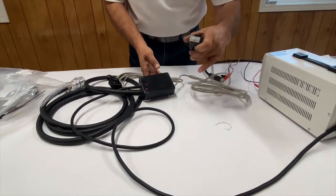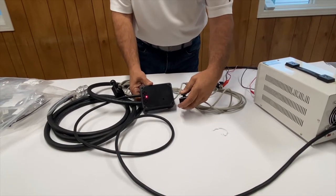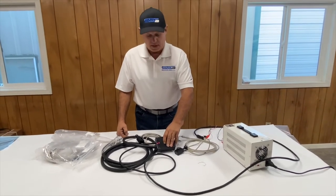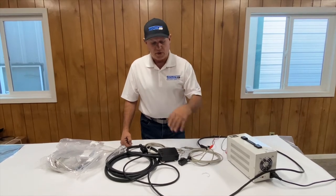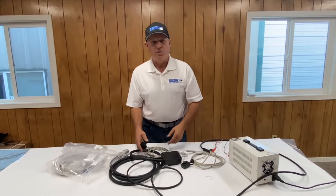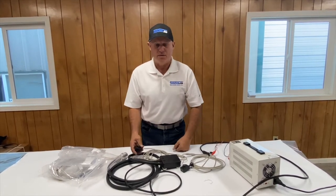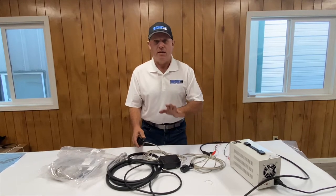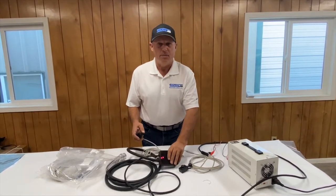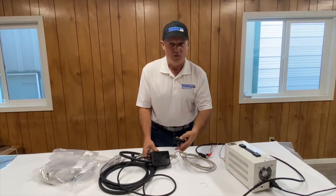These are my latching ones. I push down in the middle here for six seconds — this is important to know because this is for latching features. Things like if we want to turn on and off lasers on our graders or on our boom, or we want to turn the mower connection on, it makes us wait for six seconds so you don't accidentally just bump it and turn the mower on when you've got bystanders nearby. This gives you time to think: I'm actively wanting to turn that part of the attachment on. Now if I have an emergency I can just quickly click it and it turns off — so if you want to turn things off they go off very easily.